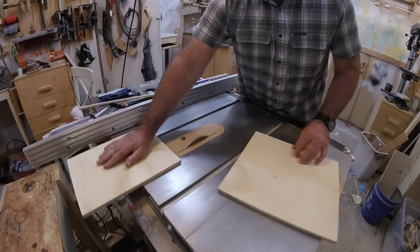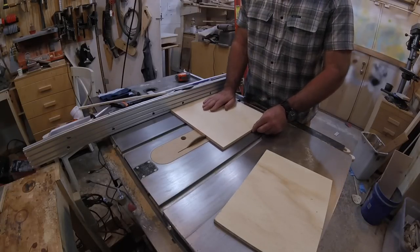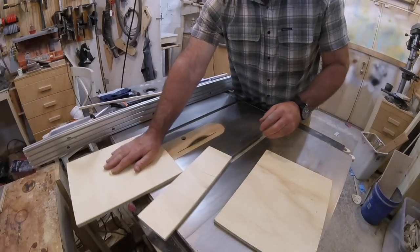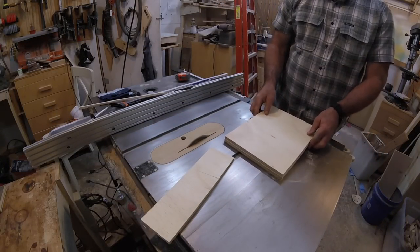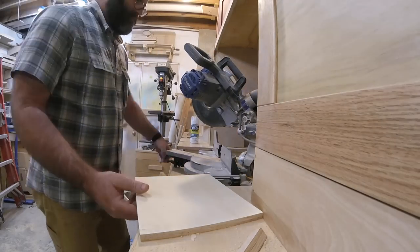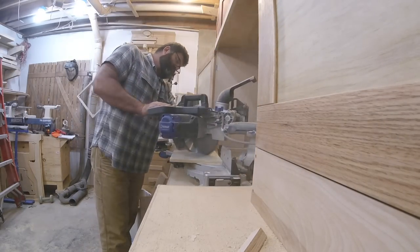So now I'm going to show you how I made the jig and show you what I used to make the jig work like a champ. The jig is shaped like a wedge, so I'm going to need a bottom and a top. I cut both of those to around 10 inches by 13 inches. For the sides, I'm going to need two triangles. The angle I'm going for is around 40 degrees, and I'll explain the need for the angle a little later.